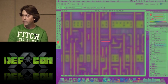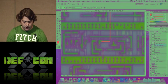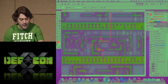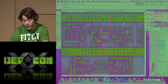It's all rotational alignment. So this gate, here we can see here, this is A, hypothetically, and then this is B, and then this would have been Y, but it doesn't. There's no via, nothing. It's just completing the gate. And they're not spares. These are not like spare NANDs or NORs. And let's see what it is though, because I don't know what it is.